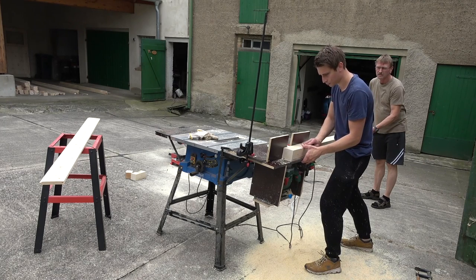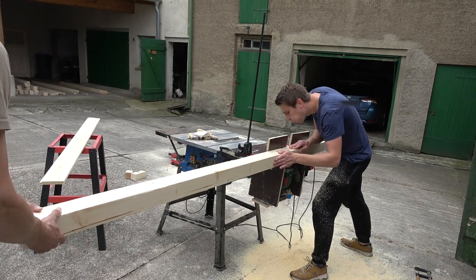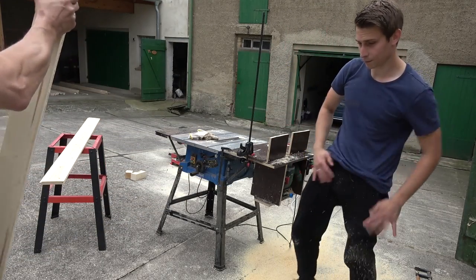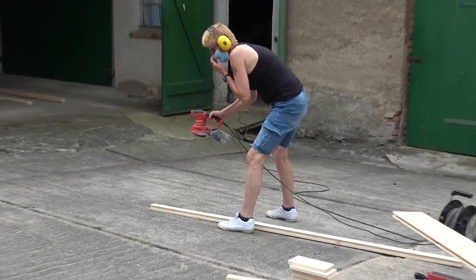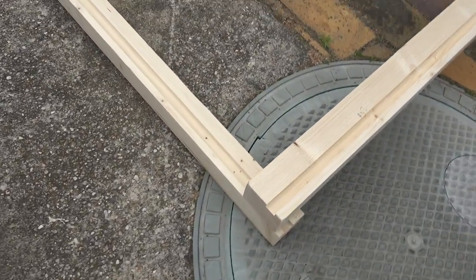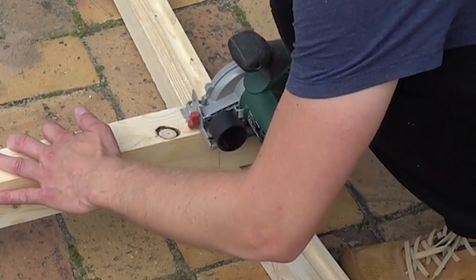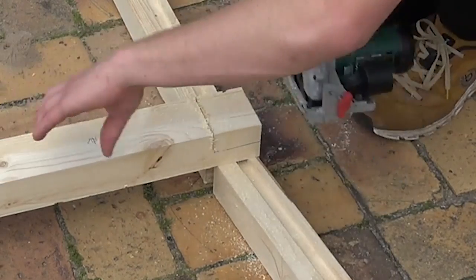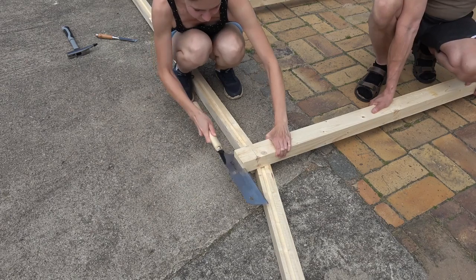Next comes the base that will sit in the foundation. The outer perimeter will once again be embedded with grooves in which the walls will sit. And that's my mom's sanding. The inner bars will be fixed to the outer frame with simple half and crosslap joints held in place with screws — pretty easy procedure using a small circular saw in combination with a Japanese hand saw and a chisel. So proud of her — she did that real well.